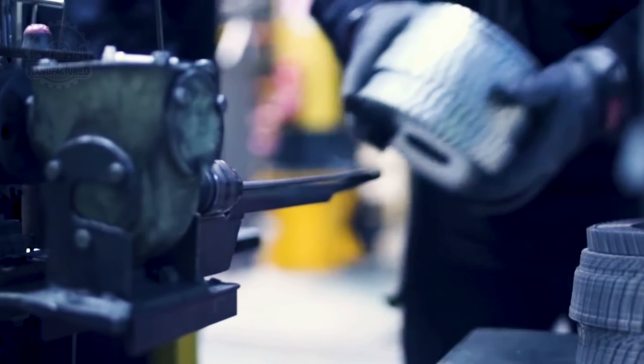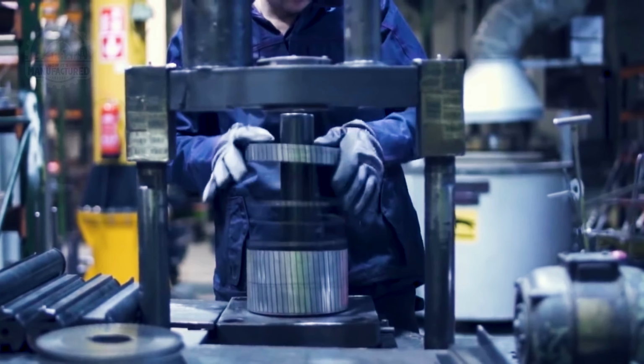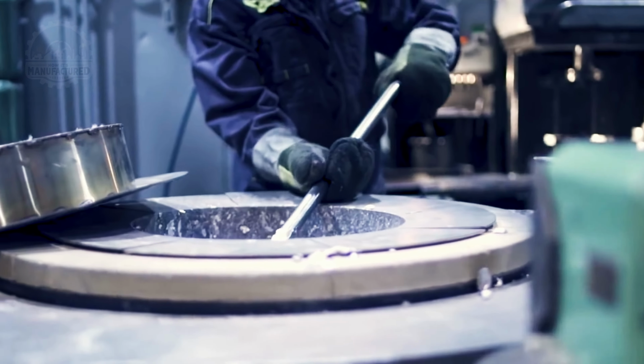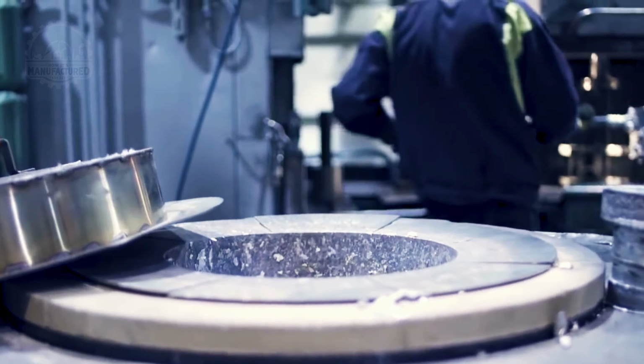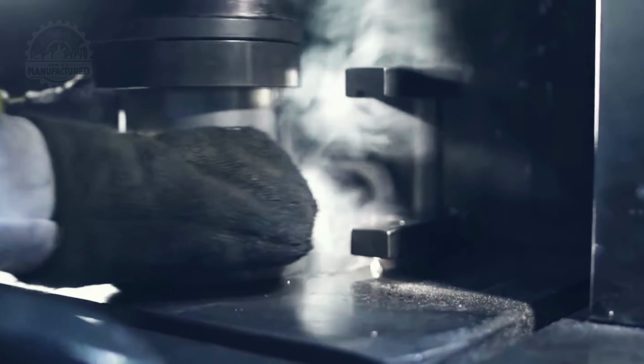Stator laminations are stacked and welded together, then rotor laminations are stacked and cast together. For that, a molder fills the grooves of the stacked rotor laminations with molten aluminum. This procedure is only seemingly simple. In reality, it requires flawless execution and must be carried out under very specific conditions.